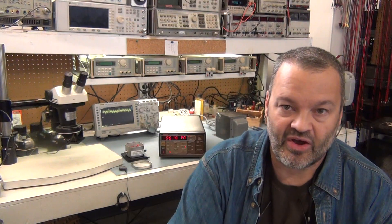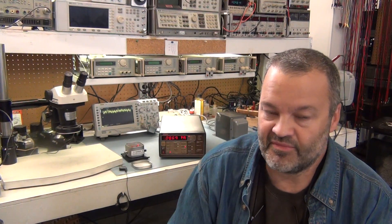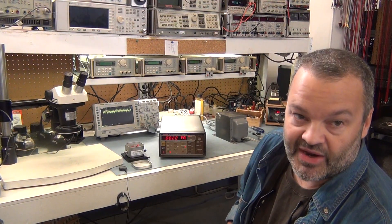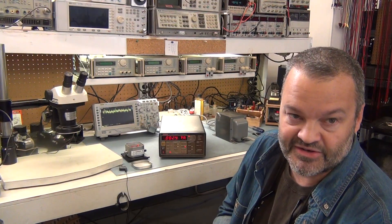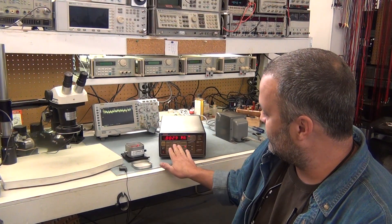Because these relays don't have an electrostatic shield, I get a little more noise out of the analog output connector on the back than might be normal. This scope display right now is 10 seconds per division, and it's one femto-amp per division vertical deflection. I'm well within the three femto-amp promise of the LMC662AIM, and you can see the display is very stable. Because it's a sampling ADC, it probably has a low-pass action, but if you're looking at the analog signals on the output, there will be more noise.